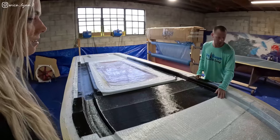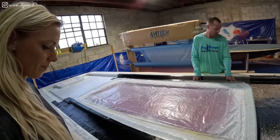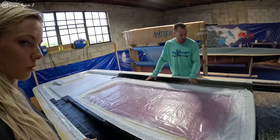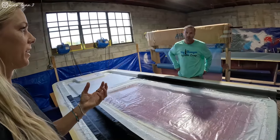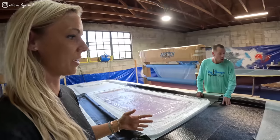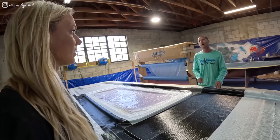It's not that much weight. On yours we have a second layer to give it a little more stiffness. We dialed back the laminate a little as an experiment on your boat to drop some weight. This part of the cap is very thin — it's all supported by the boat — but we put it in anyway. It has two layers of uni going this way, so it's going to add a lot more stiffness. Even in the original one there was no flex in the boat at all. Three-quarter inch core is going to be sturdy but lighter — a win-win. We're trying to remove weight off the top of the deck and keep it low in the boat so it's not as tippy and gives a better ride.